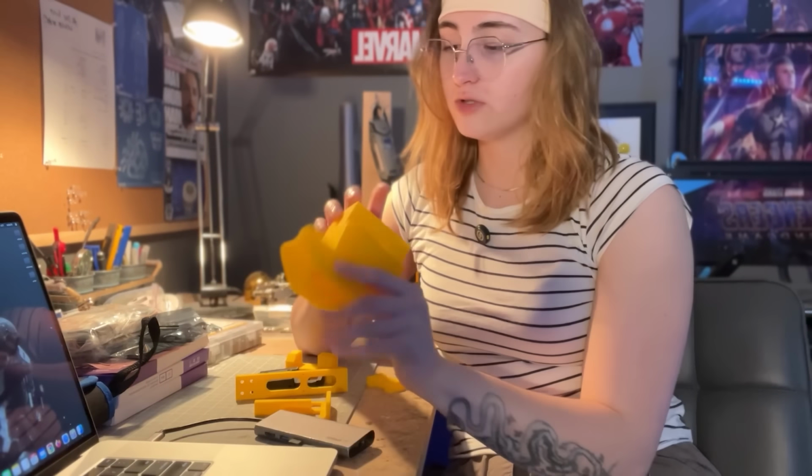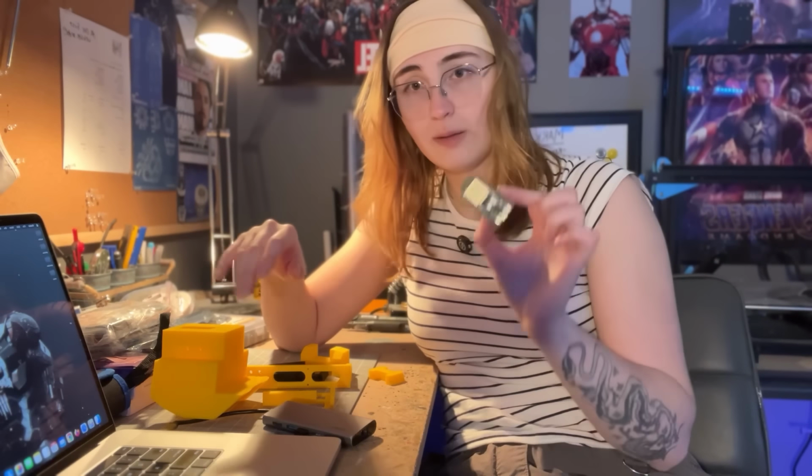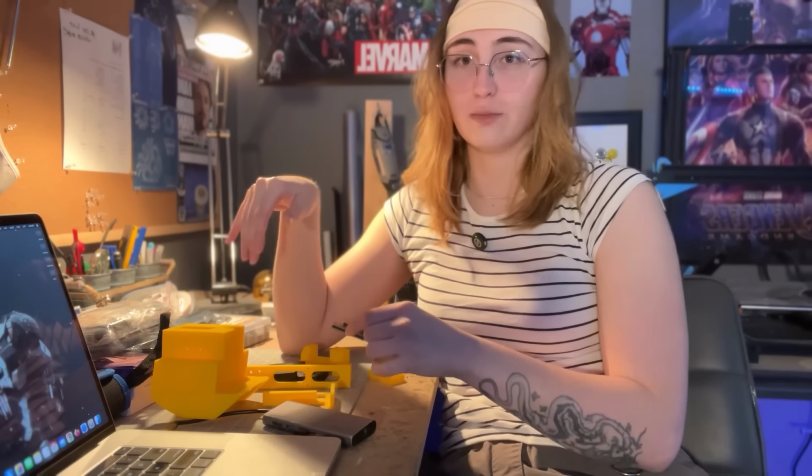Okay, so now what we're gonna be doing is starting to assemble the actual robot part. I'm gonna start with the neck base and work myself up. The really cool part about doing this while I have the Bot Tango model all rigged up is that I can plug my board directly into my laptop and direct the motors while I assemble this. So I can make sure everything's in the correct position, and I'm assembling it correctly the first time. Last time I had to disassemble everything and reposition all the servos, and that was really annoying. So this should be much faster than last time.